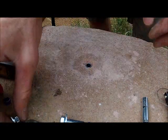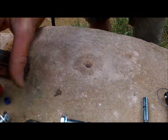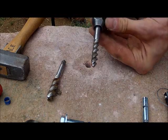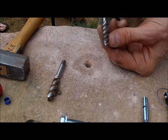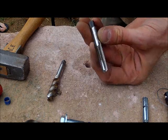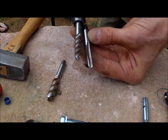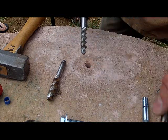I'm going to shove that back down in the hole and do method two. If the sleeve doesn't come out willingly, which often is the case, we'll use a tap tool. This is a 3/8 tap — it's not your garden variety tap, which would look like this. Those break really easily; they're just too fragile. This is the same thread pattern but it's a really heavy-duty spiral tap that is better suited for the job.